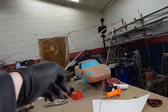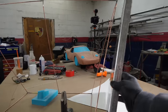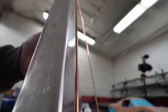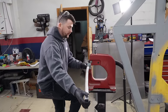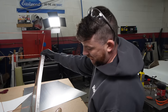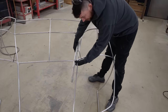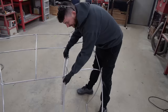So Tony, now you've spent a lot of time making that perfectly straight - I realized something. Our wireframe, the curve with the shape of the body, is not perfectly straight. So we actually need to have it match that curve. Right now my piece, if I match it up to the wireframe, there's a nice gap in the middle because it should be curved. You want to play the game where I do this once and we see if it matches perfectly? That's perfect. We really need to just check on the car with the tubing - I don't know exactly where it goes because this angle matters, it changes the radius.